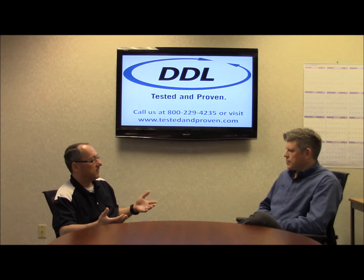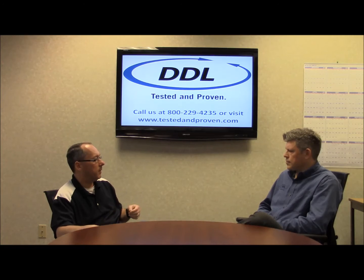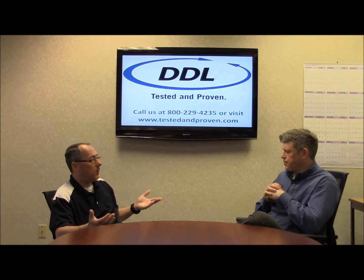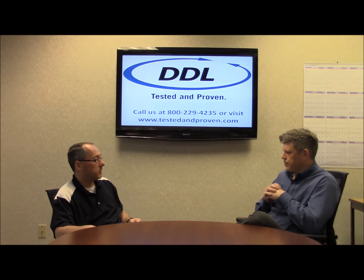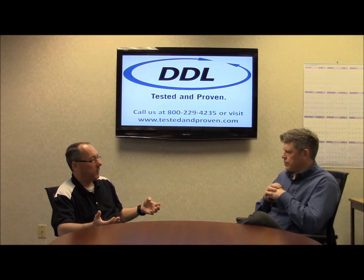When you're doing seal strength testing, you're going to want a lower load cell — a 10 pound load cell; 8 to 10 pounds is more than sufficient. Does this mean anyone can just do this test? Well, they can. Anybody can go out and buy a tensile tester and execute F88 testing. But the key thing with all of this is the load cell is important, the piece of equipment being calibrated, and then for the standard itself, running a test method validation. The repeatability and reproducibility is a critical factor.